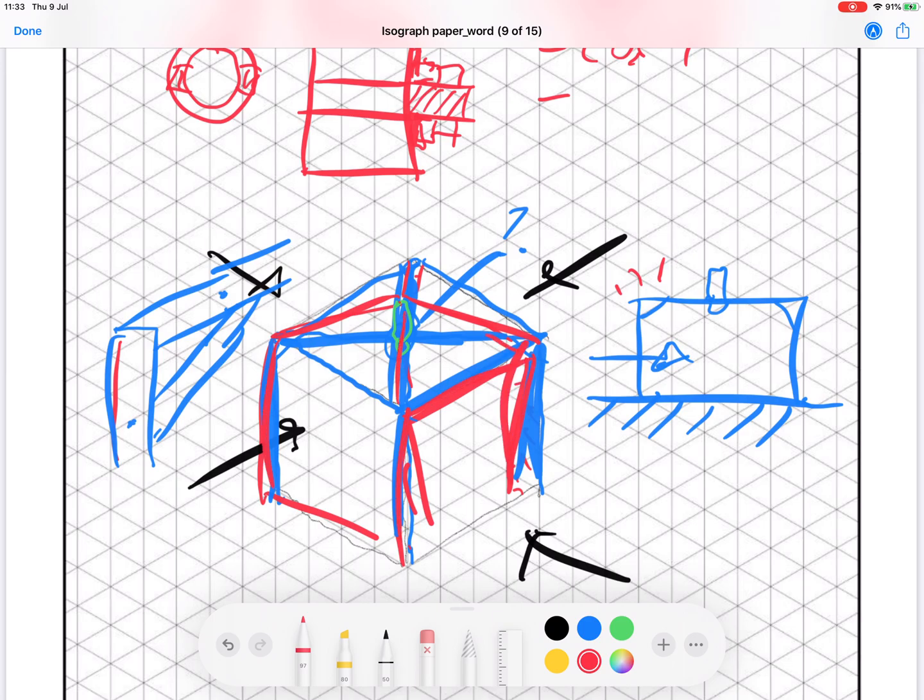So you've created a doorway entrance here, but what I would also like you to consider is that you could probably stiffen it by having cross braces between each of the legs. So just replicate that brace around the structure, so that it's incredibly stiff. It will also mean that there's not a lot of extra stress going through these points.